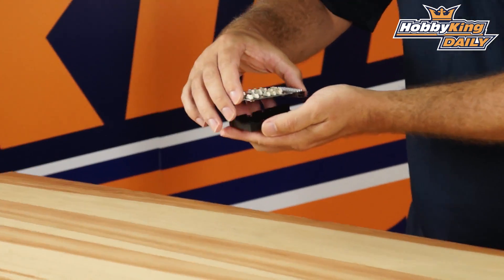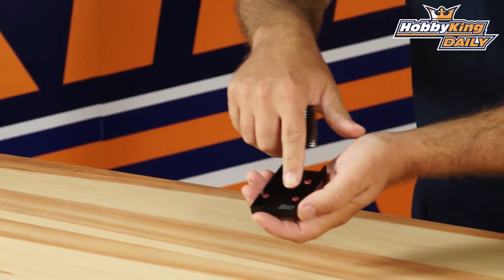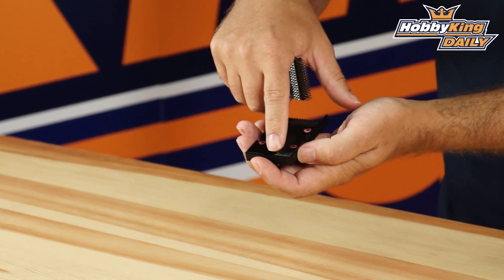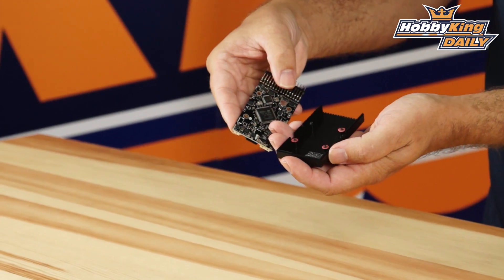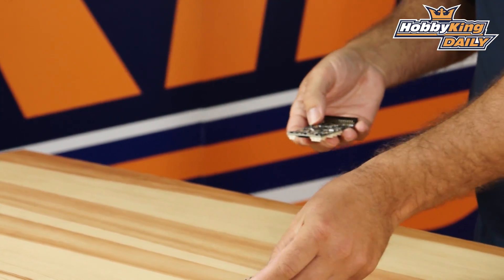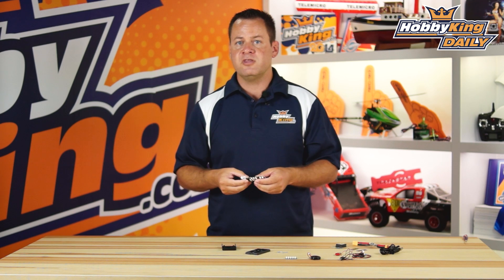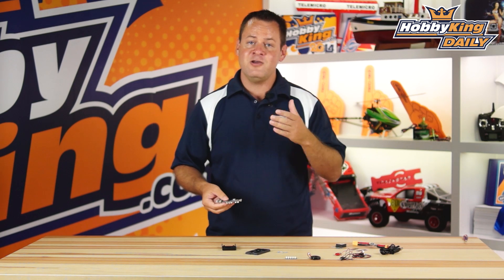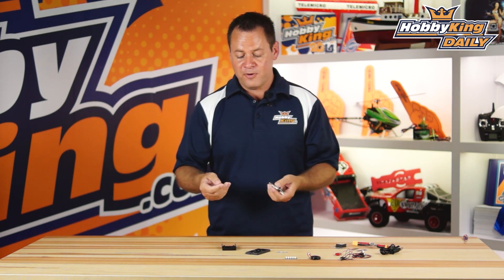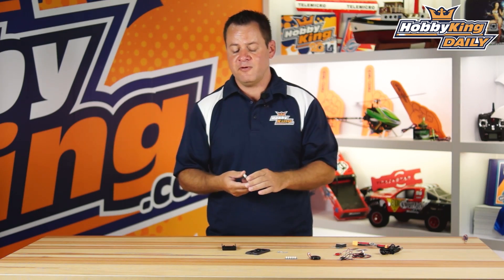Take a look at the inside of the case — there's a small black foam piece locked into the case. When you flip the PX4 board over, it lines up with the barometer itself. This stops any deviation in the barometer from propeller wind or whatever the application, giving you a really locked-in reading. It also uses advanced low-pass filtering with the 32-bit processor using accelerometers, so you don't need to open the case and stuff cotton in, as a lot of people have done.